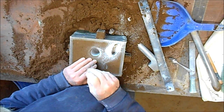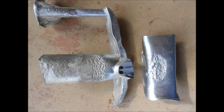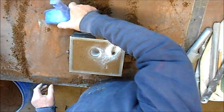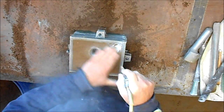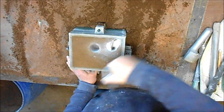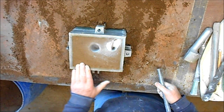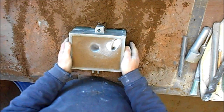Radius the sprue-basin junction down there. A little vent down here — this is a very fine piece of stainless wire — nice and hard. Now let's see if we can get this apart. Loosen it up. Unfortunately that hopefully loosens the sand on the pattern, but it also loosens the sand in the box, so I'm going to push it around the edges to try and tighten that back up again. With luck it'll all work.